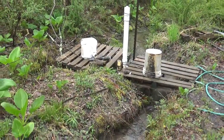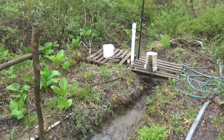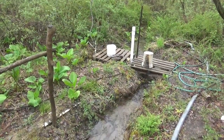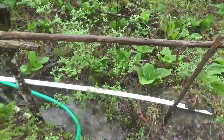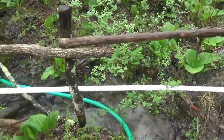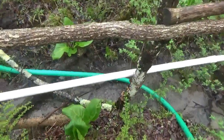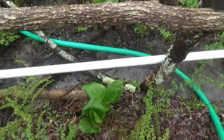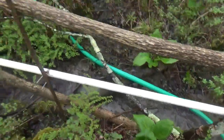I noticed some surging on the ram pump up at the greenhouse last night. The water was surging a bit as I did some watering. Pretty sure we have a saturated pressure chamber problem. I just thought I would get a shot at what that sounds like before I flush it, drain it, and clear it.